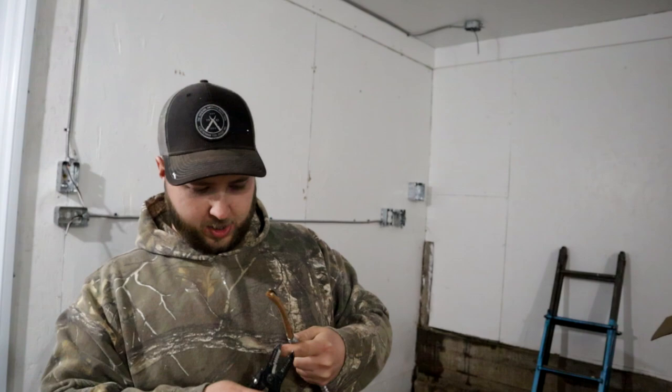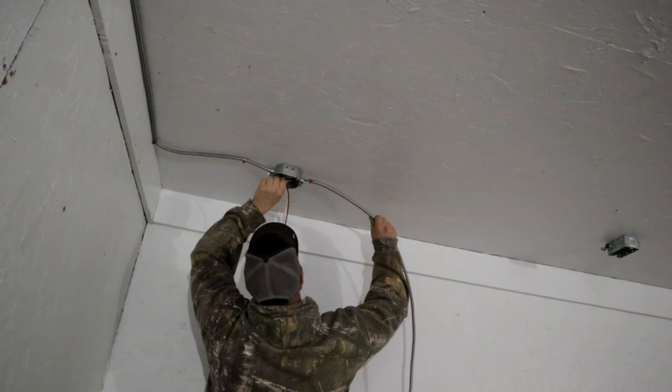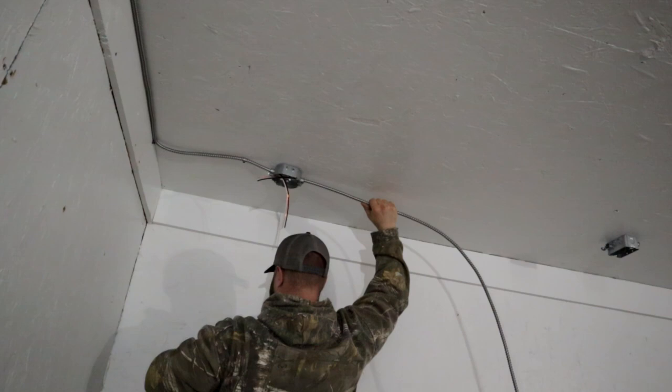I haven't done a lot of electrical wiring in my life anyways, but this is the first time I've ever been around BX cable. When I was looking at wiring solutions for the shop, I was thinking conduit was the best solution because I did want my wiring outside the walls for a couple reasons. I want easy access to be able to move things and change it as the shop evolved or as I might need to add on. And I also wanted sort of that industrial look of conduit or the wiring outside the walls. Now, I was advised by a couple different electricians, including Cody, that conduit was not the best solution. So, per their recommendation, I went with what's called BX cable, or steel braided cable, external to the walls. All cans are outside, and I could not be happier with the result.